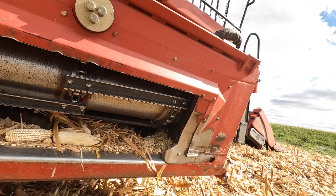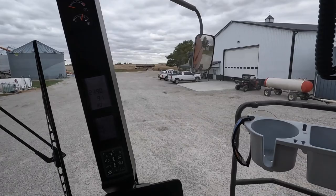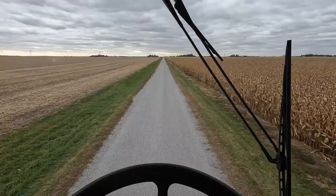You can see that side's a lot higher — jumped the sprocket. I gotta loosen up the chain and hop it back on in the right spot. We got the feeder house all straightened out, but the reason it's jumping is the guide for the slats on one side was bit up a little bit, so it was throwing it off. I'm taking this combine to the farm. I gotta heat up a piece of metal that runs the slats and beat it back down so it's straight and flat. Dad's still running so at least one combine is still doing something. We've arrived at the workshop — let's get this taken care of.